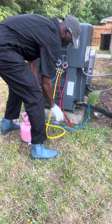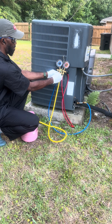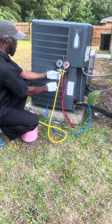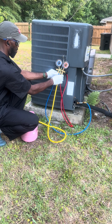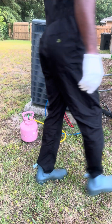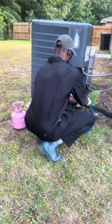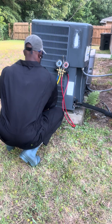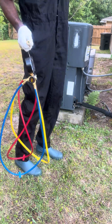Once you've put all your refrigerant in, turn the unit off, go outside to take the lines off. First thing you want to do is burp the lines — all your manifold knobs are closed — and you burp the lines like you see me doing right now. I ended up putting about a pound and change, about 18 ounces. I am EPA certified but I don't work in the HVAC field, though I've had to charge units before and this has always worked out for me. I charge at the low side a lot of times. I didn't want to over-complicate this video — not claiming to be an expert, just saying what I did. Thanks for watching guys.